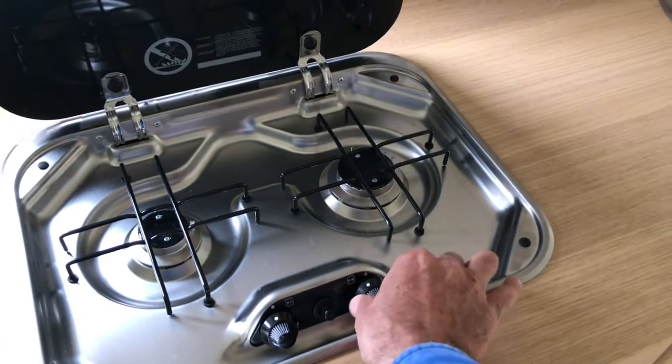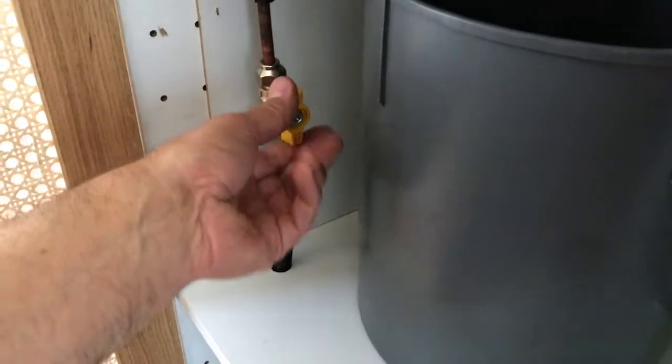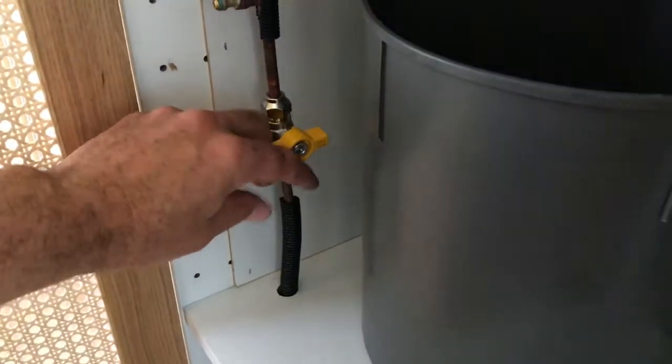You've got to have permanent vents on a caravan if you're going to cook inside. Little Millie's got permanent vents — I just had to trim a bit of flashing. It's got ventilation all the way around and they are permanently open, so she can cook with even the hatch down, though it's good to leave it open. Inside the cupboard there's also an isolation valve to shut the gas off in case of emergency.